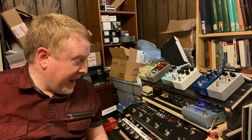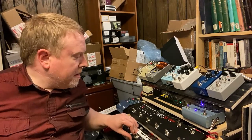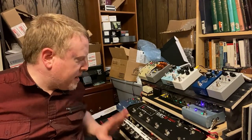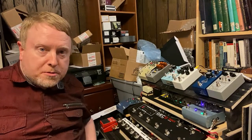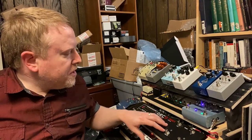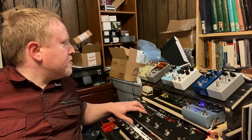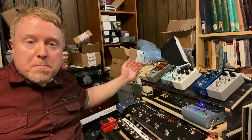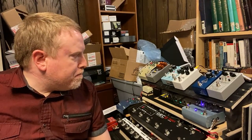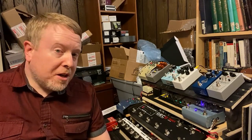I tried to design this so that wouldn't happen. This loop switcher isn't buffered at all, but being a loop switcher itself should help some, so that when these pedals are all off, the signal's not going through all of them in bypass, but instead just going through this. All the Boss pedals, of course, are buffers. So right after this loop switcher, it goes into the MD-200. The GEC9 loop switcher has a buffer — only an input buffer, it doesn't have an output buffer. And then that's going into the Terraform, into the DD-200. Boss pedal has a buffer. Goes into the RC5 loop station — Boss pedal has a buffer. So I've got buffers spread out throughout the signal that should be keeping that signal loss from happening, and they're not.